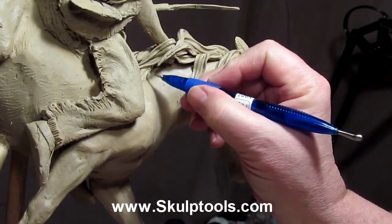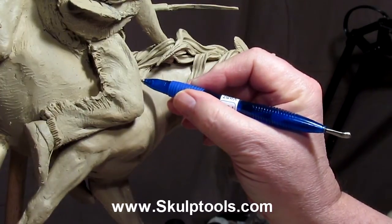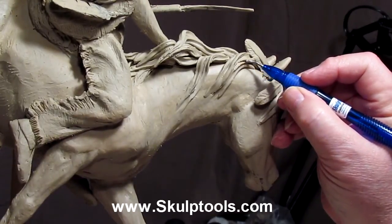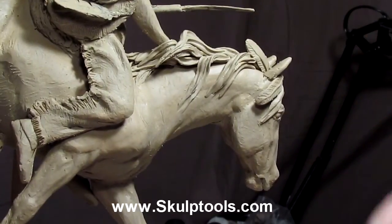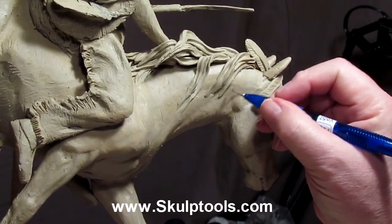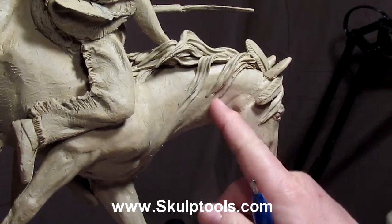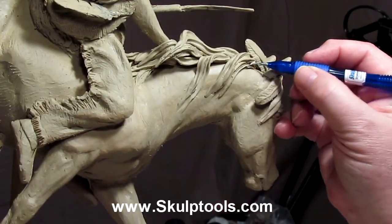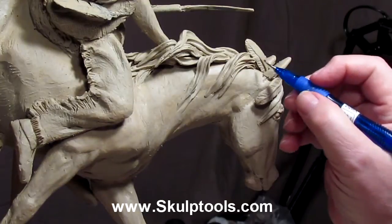— and the investment is the shell that's left on the bronze from the ceramic mold — you don't want to have deep cuts. You want to have texture and lines in your hair, but you don't want deep cuts that require a lot of sandblasting and chipping to get the mold material out. So it seems like a pretty good tool for that.